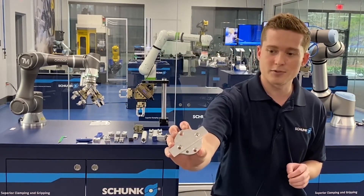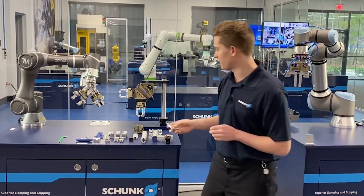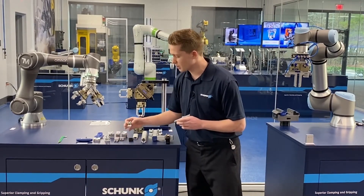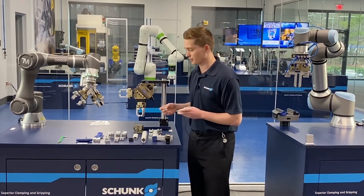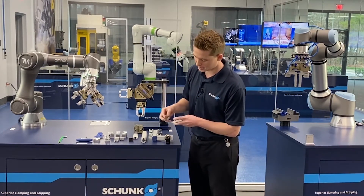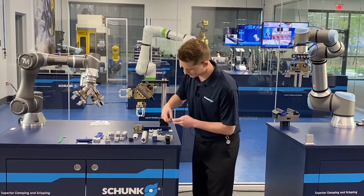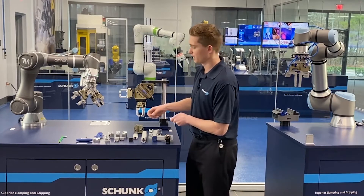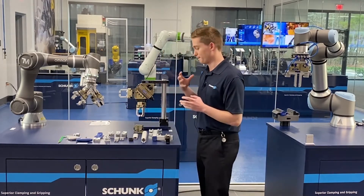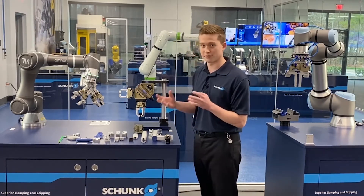You can see that's an adapter plate that goes back to the robot — it has that dovetail plate. What's key about that dovetail plate is that it allows you to have flexible bracketry, which can be combined to create different kinds of tools. Typically you just have two screws here that come into place. It slides onto that adapter plate and can slide up and down as needed. So with the wide variety of bracketry within our kits, you can create a number of different types of tools.